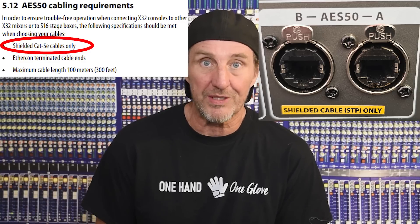It turns out that AES-50 is vulnerable and susceptible to ESD — electrostatic discharge. So if you're on a carpet or in a very dry environment, maybe at a balloon farm full of sheep, and you have sparks when you touch anything, that electrostatic discharge causes AES-50 to fault. And what does the fault do? Pops and drops that shuts down your show.